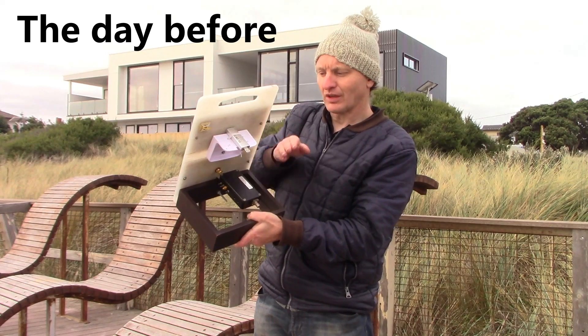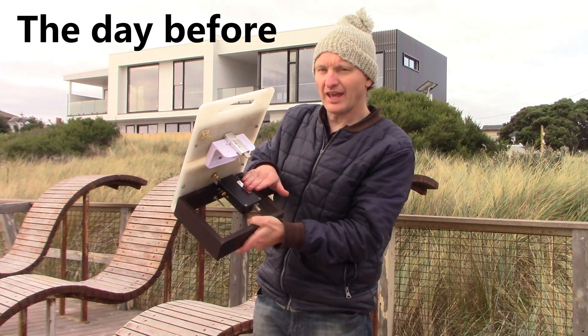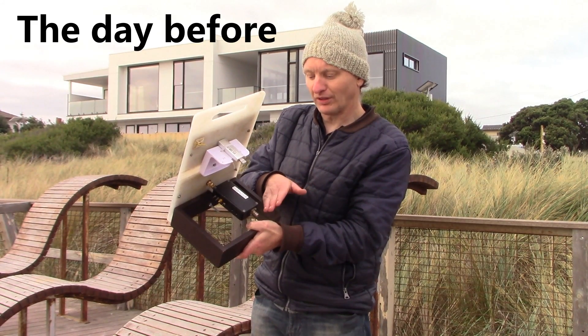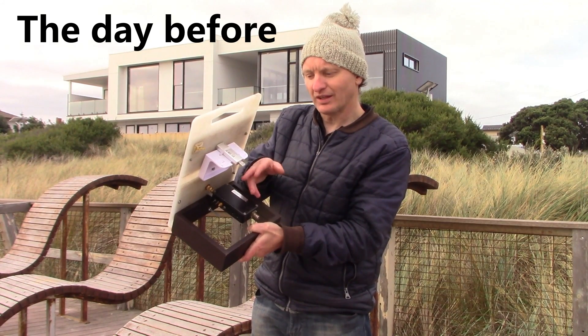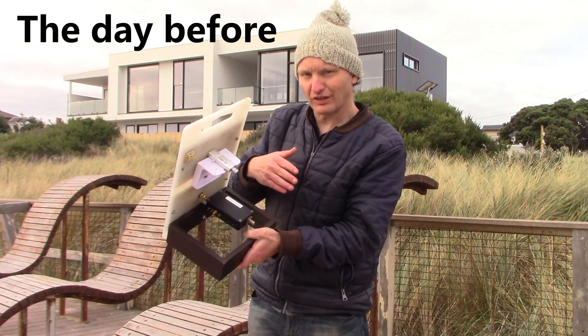Here's a look behind: the USB, the RTL-SDR and my frequency tripler. With this I can just apply power from the 70cm FM transceiver, and on the top just connect a USB cable going into the computer.